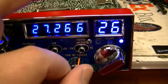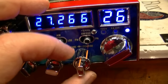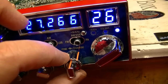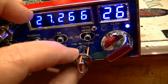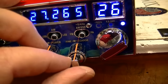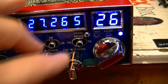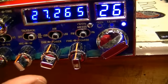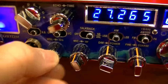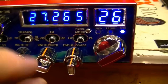I tried to center it up so you'd have the same amount down as you do up, but then the center on the clarifier was way over to one side. In other words, that would be center — it would go up the same distance and down the same distance in terms of frequency movement, but that's where the knob would sit. I figured you'd probably like the knob sitting at center for the center frequency. I got the new control for this the other day and I'm going to be replacing it — the little one got bent and it's moving together — but I'll fix that. The clarifier is taken care of.